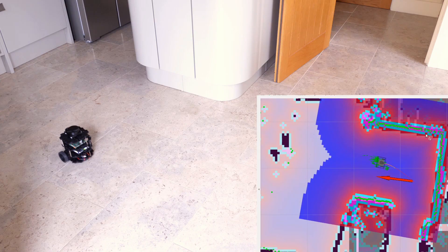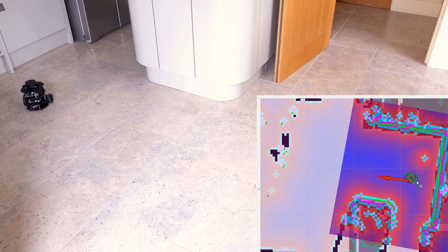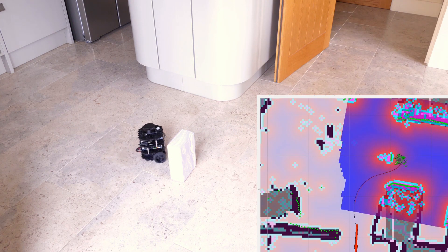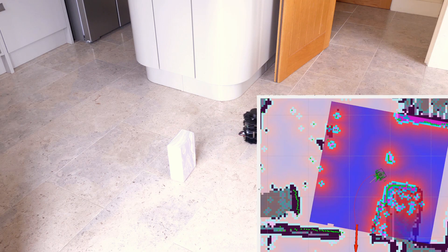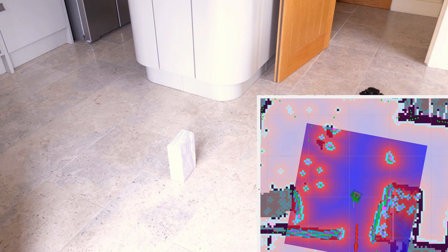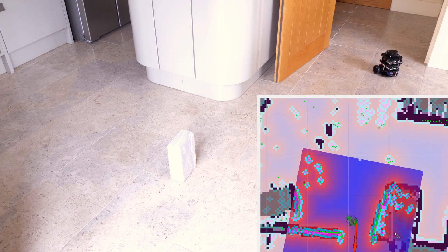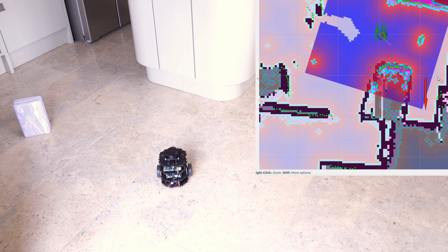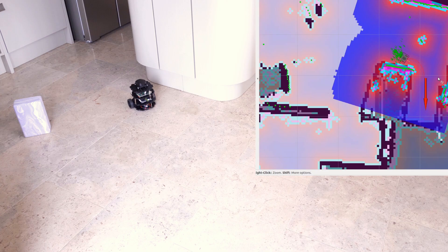That's quite useful if the robot had a manipulator which would then do something when it got there. Now we're going to try to confuse the robot by adding something that's not on the map - I'll plan a path into the doorway and then put an obstacle in the way; it has to be high enough to be seen by the laser scanner. You can see it dynamically adjusts the path, the block appears on the laser scan, and it completes its path avoiding the obstacle. For the next example we're moving the obstacle while the path is already being planned and we can see it dynamically drives past it - it can deal with temporary objects, and those disappear when they go out of range.